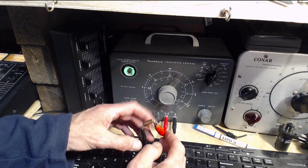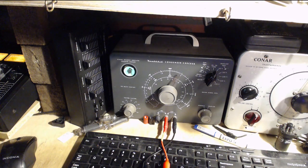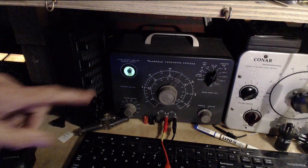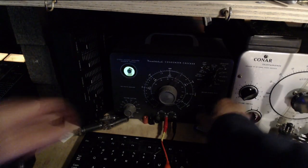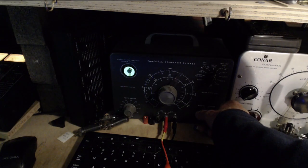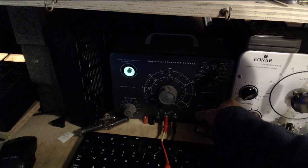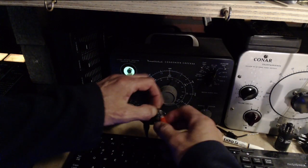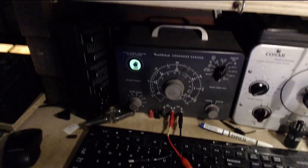Okay. Okay, put your money down. I would say the 50 volt test, the lowest voltage test, this eye is going to stay closed on this piece of crap capacitor. Are we ready? Is everything set? Yes, it is. Here we go. Boom. And it opened. Oh, it opened about 3/4 of the way. I think we can bet at 150 volts, nothing's coming open here. So, yeah, it's as bad as it looks. Not sure they can get too much worse than that, really.